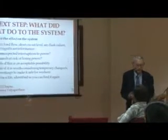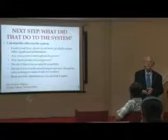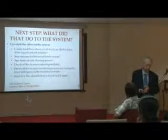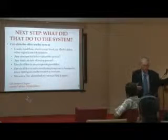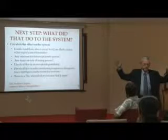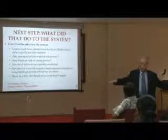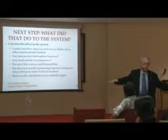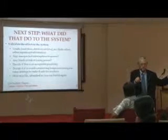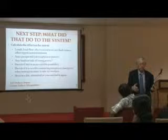This is a new bus that was installed in 2011, on a military base in Alaska at 480 volt, and they have a big station service bus for a powerhouse, another big station service bus, and some transformers feeding it and loads, and they're critical. You don't want to lose the power. And they have a tie breaker in between, so if this bus is de-energized, you can close the tie and feed it from the other. The system is adequate to do it.